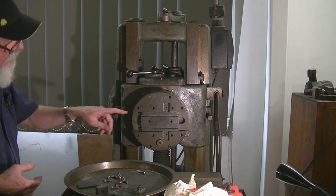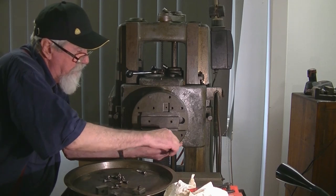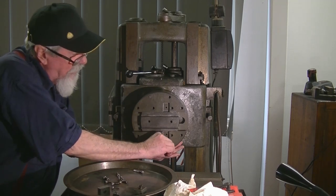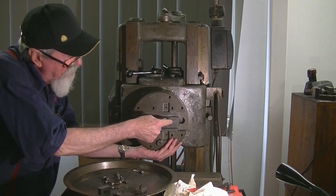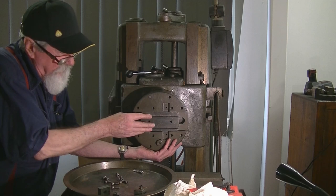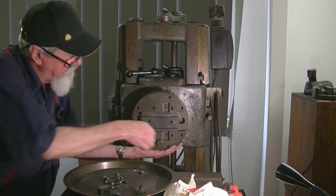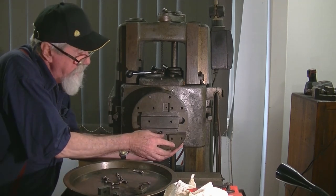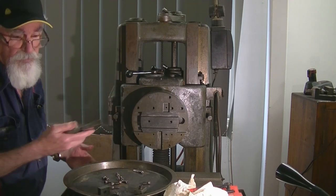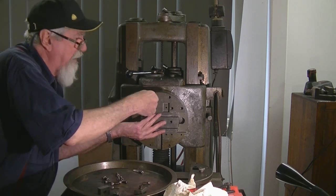I'll take the last screw out and lift the mechanism out — then you'll see what feeds it behind. There's also a short socketed cap screw that goes in to lock the slide to the feed nut. I couldn't find it, and it was protruding above the surface so the bar holder couldn't slide over the top. I've made a special replacement screw — I can identify it later by finding the one that's been ground on the head. There's a little sliding plate that just slides backwards and forwards inside the keeper plate. Quite a simple mechanism.